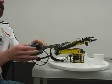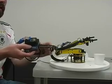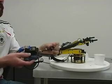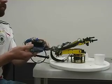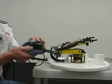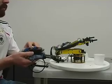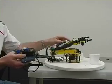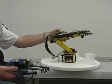We see here a SunSpot that is connected to a game controller. The bending resistors in the fingers are connected to the general purpose IO pins. We also see several vibrators from used cell phones hooked up to the general purpose IO pins. We are using this SunSpot to control a robot arm by reading the values of the 3D accelerometer, sending the data wirelessly to a second SunSpot. The second SunSpot processes this data and calculates values for the seven servos in the robot arm, which are controlled via its IO pins.